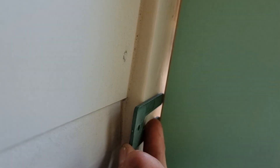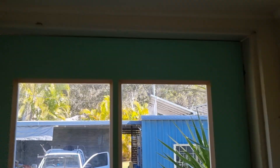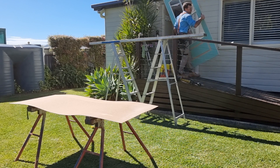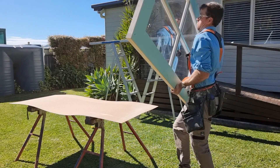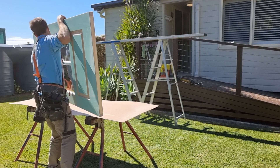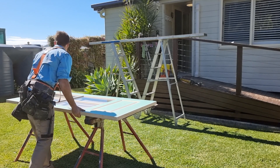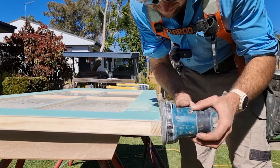When I got on the inside it's pretty much bang on my 3mm - probably a quarter of a mil off so it's not even worth touching. My top is nice but a little bit tight there, so I'm just going to take that tiny bit off. I'll use the sander to get to that line because it only needed about a quarter to half a mil.